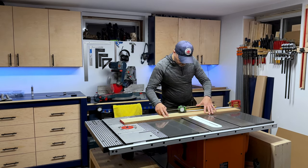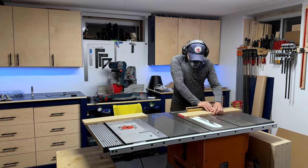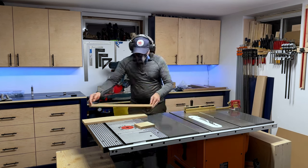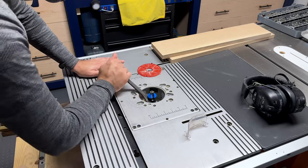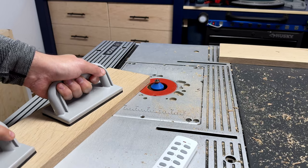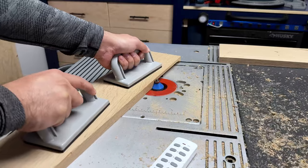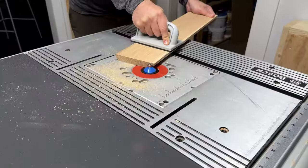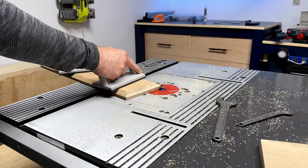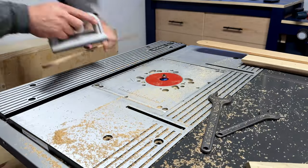For the base, it's about as simple as it can be: cut the pieces down to their final dimension. To get a nice modern non-DIY look, I put a nice big chamfer on the bottom side. Then I brought out the 1/8-inch round-over bit again and broke all the edges to give it a nice round over.